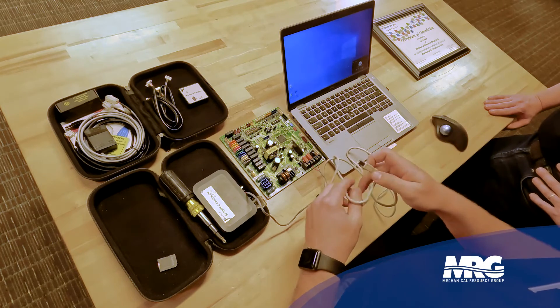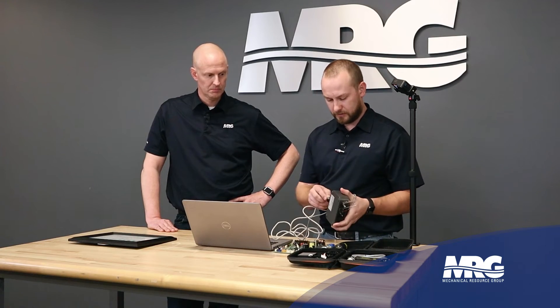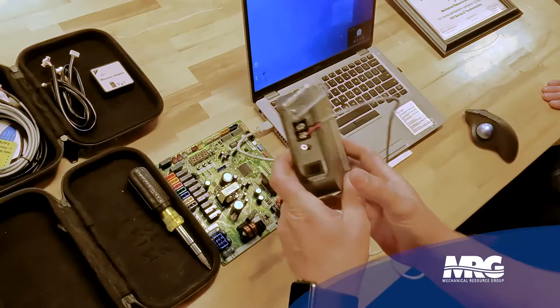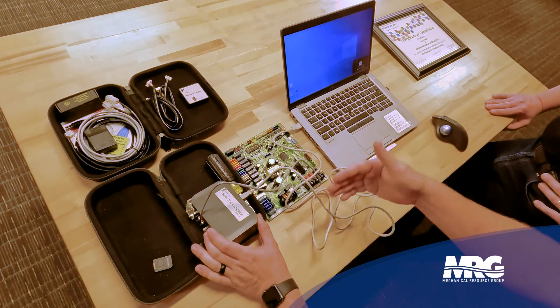The other cable is a simple USB cable that comes with the service checker when you purchase it. You plug it into the back of the service checker and into your laptop. Then power your service checker up — you are now physically connected from the service checker to the system to your laptop and can access the software. With Service Checker 4, power and data both pass through the same USB cable, unlike the Service Checker 3 which required either a 120-volt receptacle or two separate cables.